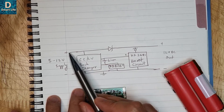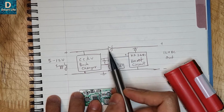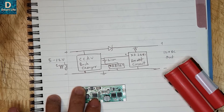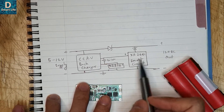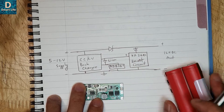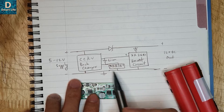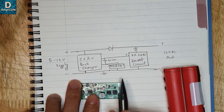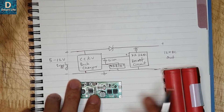These are Sanyo cells in very good condition, tested and ready. I don't want it charging at very high current. The output has a bypass system where a Schottky barrier diode supplies power directly to the output. There is also a boost converter circuit where the battery voltage of 4.2 volts is boosted to 12 volts using the XR2681 boost circuit, which accepts a lithium ion voltage range up to 4.2 volts and boosts to 9 or 12 volts. It also comes with a battery protection circuit using the XB8089, which protects the battery from under-voltage, over-voltage, and short circuit situations.